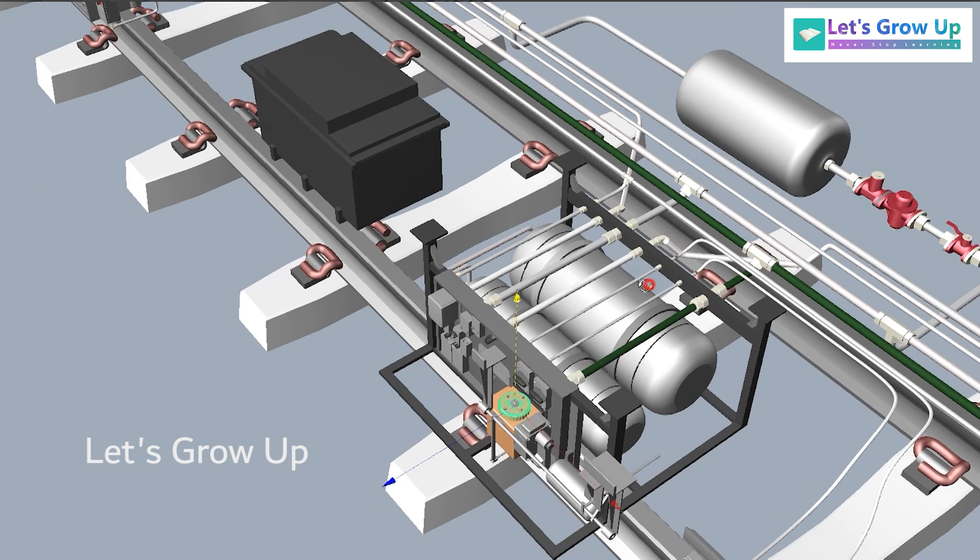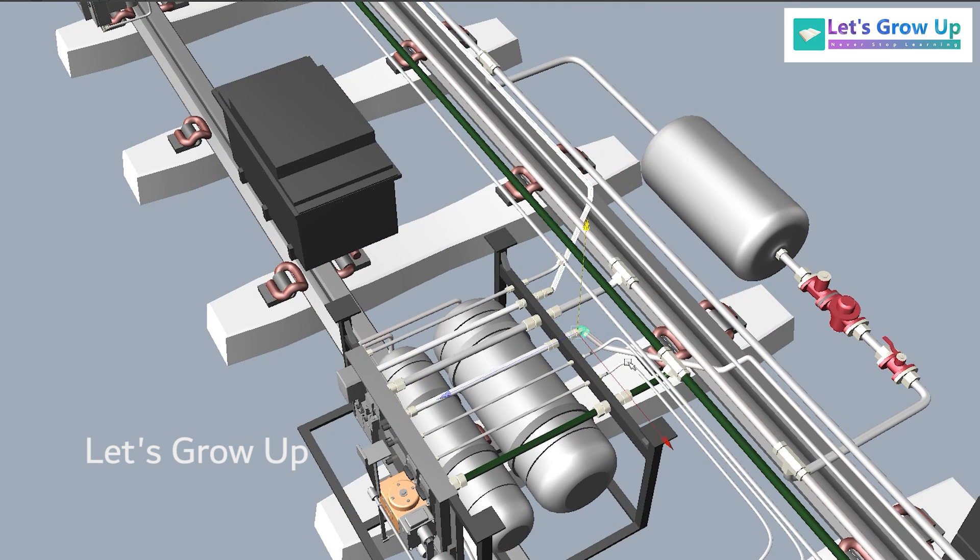From this control panel, there are many pipes but mainly two pipes for the brake application — one for the left bogey and one for the right bogey. For the brake application we need air, so there are two auxiliary reservoirs: one is for the brake application and one is for the toilet system. This one is 75 liters for the brake application. When the BP pressure drops, the DV connects this auxiliary reservoir with the brake cylinder.